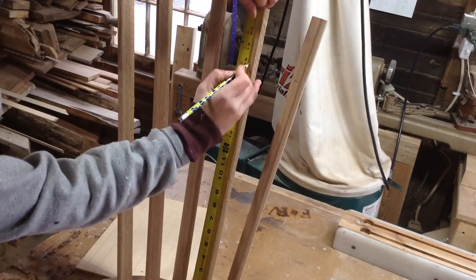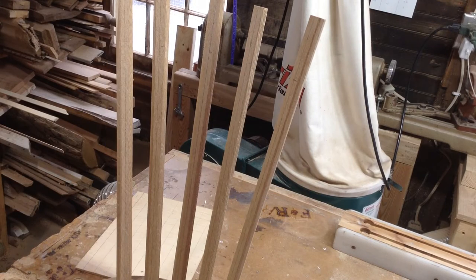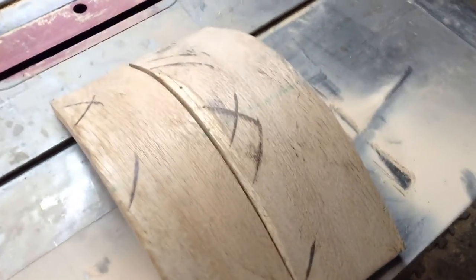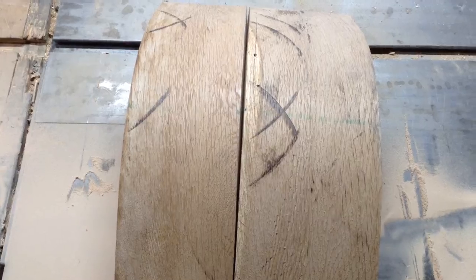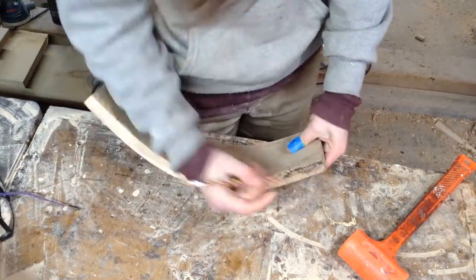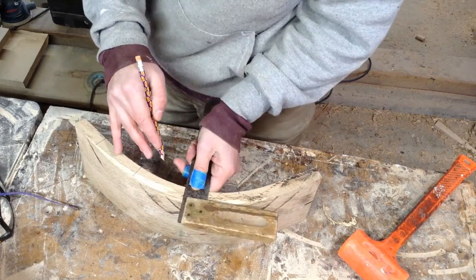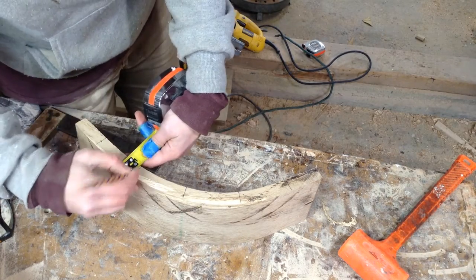I'm marking 18 inches on the back of all of these because the backrest is only going to go up to 18 inches. I could clamp that into place just to get a rough idea of what everything is going to look like. The two bent pieces had to be glued together. Since I didn't join them before I steam bent them, I took a hand plane and cleaned up the edge so they would butt together nicely. This was pretty easy because the oak planes really nicely. Once I had it planed down and flat on the table saw, they fit together — just a regular glue joint, but to reinforce it I wanted to add some dowels since this is going to be a structural part of the chair.